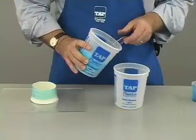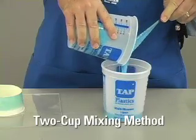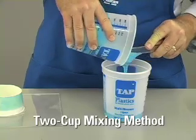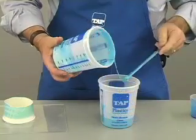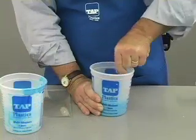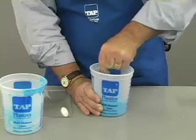That is why we recommend the two cup mixing method. Once you have mixed in one cup, pour the contents into another cup. Now the center material, which is most mixed, goes against the sides of the new cup. And the unmixed silicone, which came from the sides of the old cup, goes into the center to be thoroughly mixed this time.